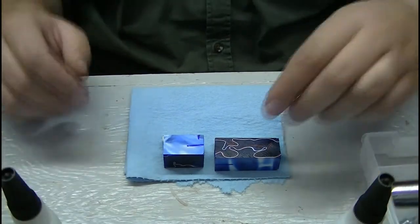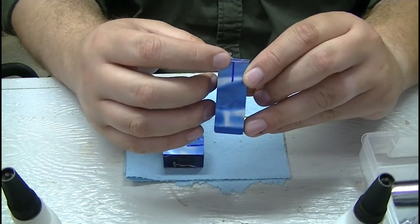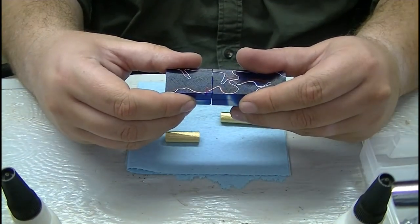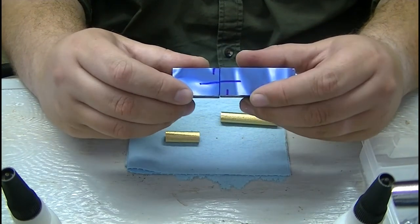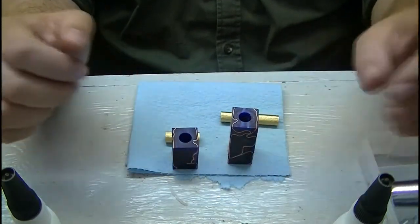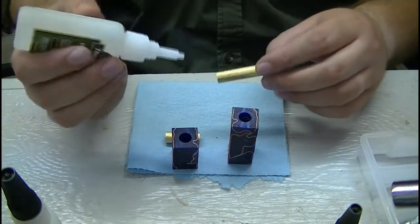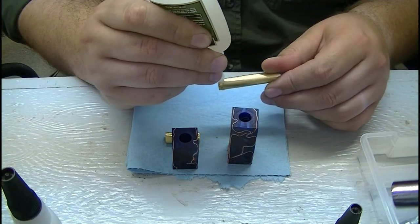All right, time to glue up this American Patriot pen kit. So when I glue these up, I always glue from the side that I have my line on, and I keep the brass close to that tube. That way, when I am lathing these down, those lines stay together and everything looks cohesive between the cap and the base. So we will put some thick CA glue on here. I am not sponsored by them, but if they want to send me some free stuff, I'll absolutely say they are the greatest product out there, even though they already are.